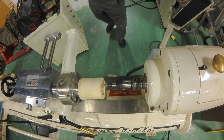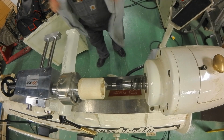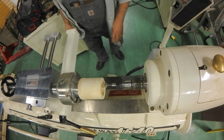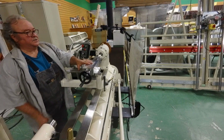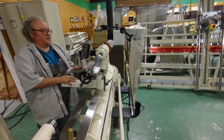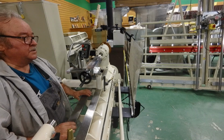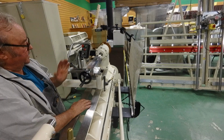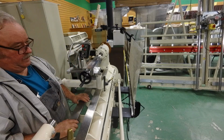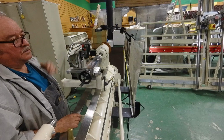Dave and I were just talking about that here. And to be honest with you, Ron, I'm going to purchase this unit. This is mine, all right? And when I have this at home, set up on my lathe, I'm going to make a jig that will fit along the bed of the lathe. It'll come up, and this will touch up against it, and it'll just automatically square it. Because this piece has to be square, running parallel to the cutter.